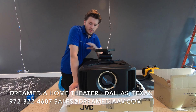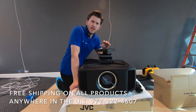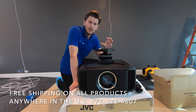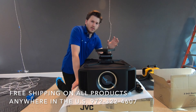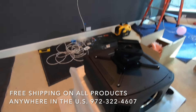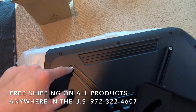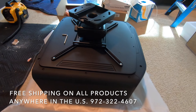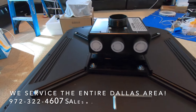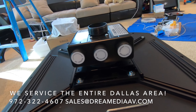I just got our RS-2000 out of the box and put the projector mount on. The mount I'm using is the Fine Adjust projector mount from Strong — the large model, which is a Snap-AV brand. I love this mount because it has micro adjustments on the back. Instead of just using a screwdriver to tighten it down, there are actually gears inside the box which allow you to click by click get your alignment just right during installation. You can see the JVC's bolt pattern is massive — huge in comparison to projectors like the Sony or the Epsons — so you need a big mount like this. What I really like is the flexibility: it has knobs on the back that you can adjust for horizontal, rotation, roll, and tilt.